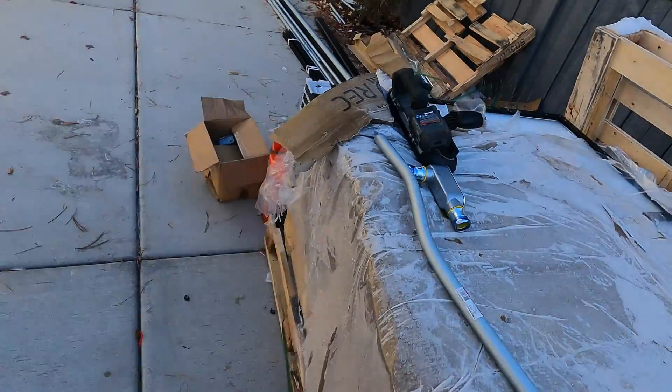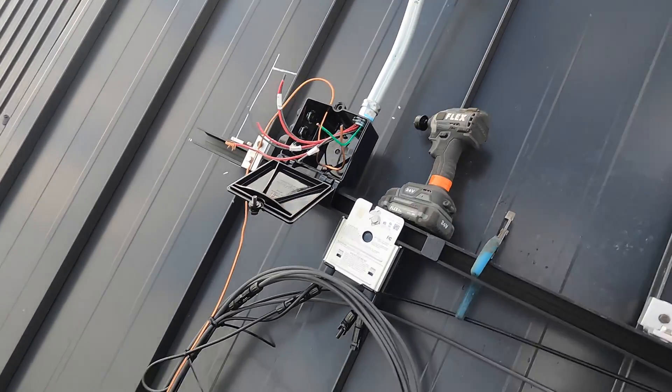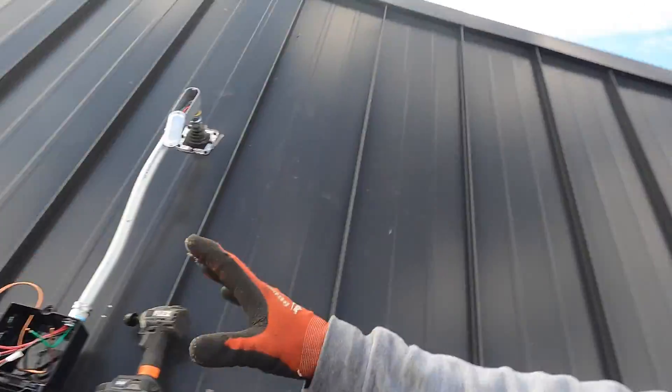I'm running conduit and pulling wire from the roof to the three inverters. I have six rows of ten, so two rows of ten — 420-watt panels — per string. Each row of ten is its own string, and six strings go down to the inverters, which get two strings each — pretty simple. I'm pulling all those wires through one-inch conduit, ran some on the back side of the meter — most of it was done by the builder — goes through the wall to a junction box. Hopefully I can get the wire pulled, all panels on, and maybe start to get things fired up today.